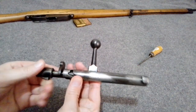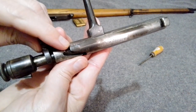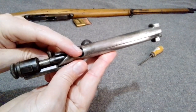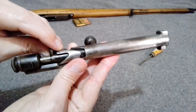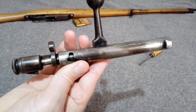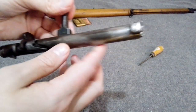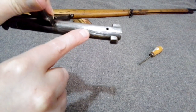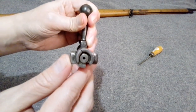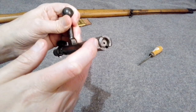I might go over a couple of the different features that you'll see on some bolts and not others — like this little witness hole here on the side of the little track where the safety goes. You only see that on some older bolts. There's also a different style extractor: this is the newer one that goes over and down and around the lug, but the old one went along the side and actually went through the lug — it was like a hole or a channel.